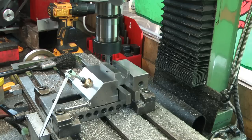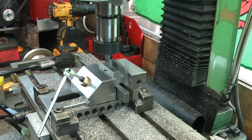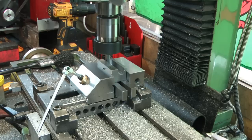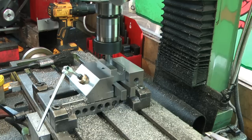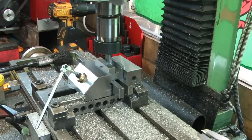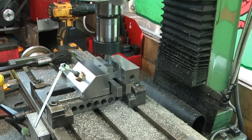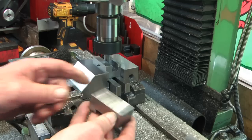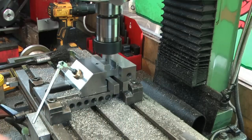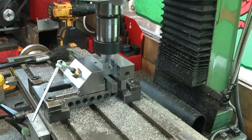So it was 1.1mm offset in both directions to get the fit I want. Maybe that's actually a 9.8mm cutter rather than a 10mm - anyway, as long as the sizes are right it doesn't matter. I've got my readings now for the consecutive parts, so I can put the others up - dovetail down, face against the back, cut the slot at 12mm depth, step back and pull 1.1mm. Job done.